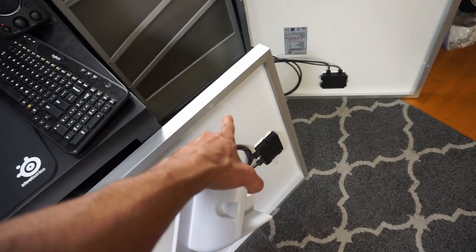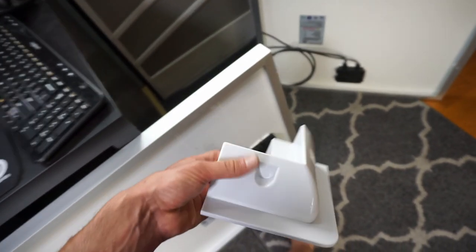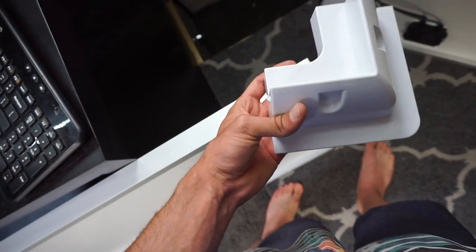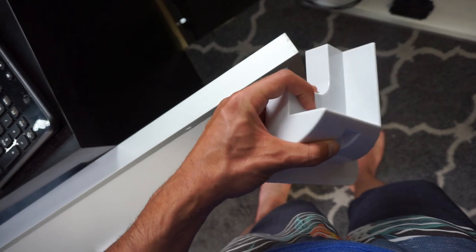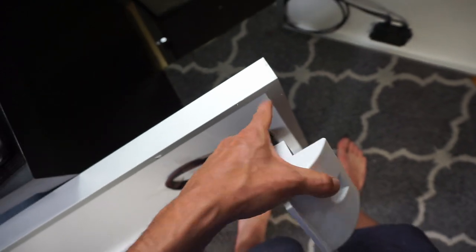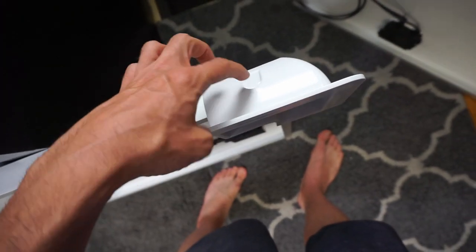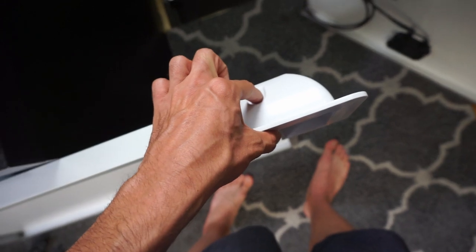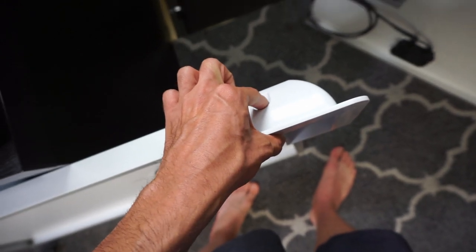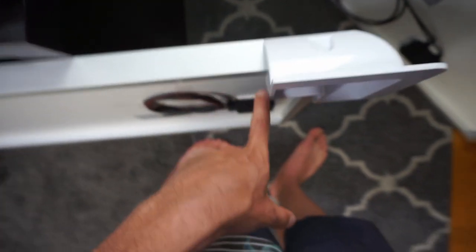If one of these flies off the roof of your vehicle, it could potentially kill somebody, so you have to be very careful. Before we mount anything, we need to make sure that all of these surfaces on the inside corner and the solar panel are dry and free from oils, because we're going to be using VHB tape to hold this corner mount, and then we're going to use stainless steel hardware self-tapping screw on the side here. So make sure that everything is clean and figure out if these actually fit.